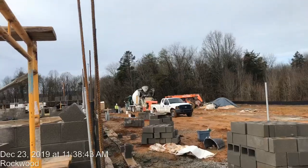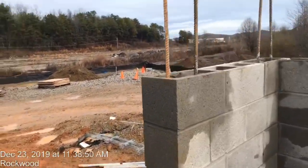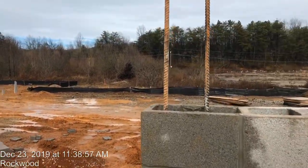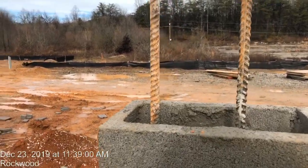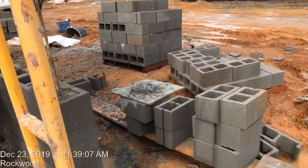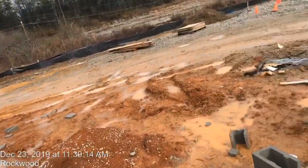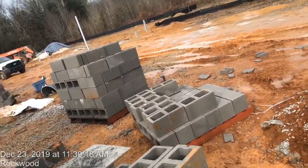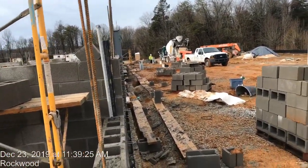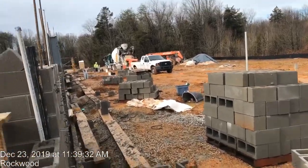You can see the concrete and also for each door opening — this opening here is 12 feet — we should install two number-five rebars on each side. You can see here I have two vertical number-five rebars, five-eighths inch, at each end. For a window opening, because it is less than seven feet, we should install one rebar on each side. Any opening less than seven feet, we should install vertical rebars at each side.